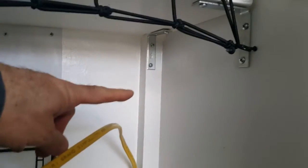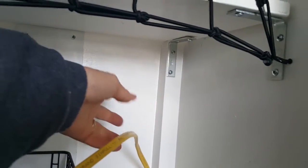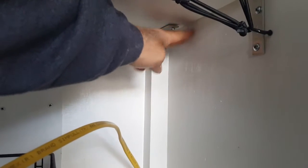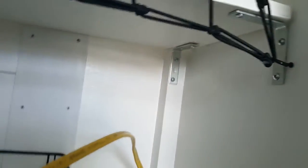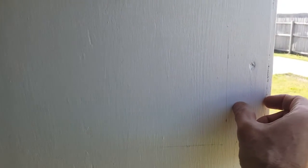I have this 2x2 that's sticking out here, so on the other side of this wall I need to make sure that I'm coming out at least an inch and a half for this 2x2 — 2x2s are not actually 2x2, they're inch and a half by inch and a half. I also need to make sure that I'm low enough from this shelf that I'm not impinging on it. So I've made a mark of 2 inches from this edge to clear that one and a half inch 2x2, and I've figured out how far above the shelf I had to be. This is the bottom line, and now I've got a pretty good idea of where it's going to be.